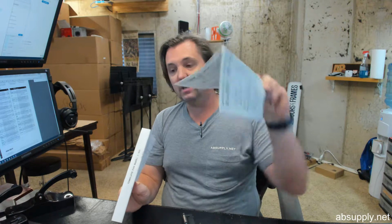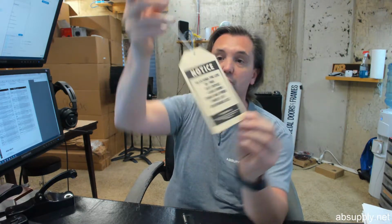Template. All of this are the installation instructions that are there. There's a tag that's here that says, extend the life of your device. Dog it when you're not using it, when it doesn't need to be locked. And obviously if it's not a fire-rated door, that would apply. That would mean if you're, let's say, a body shop, and you have the door where your clients come in, the boss comes in, unlocks the door, goes in, dogs the device down, keeps the latch bolt held in. Customers come and go all day. At the end of the night, undog the device, it's latched, exit, close the door, it's locked. Why? Well, because you're not hitting it and working the springs, hopefully, several hundred times a day, right? So that's the purpose of dogging it down.